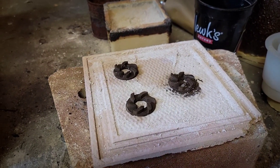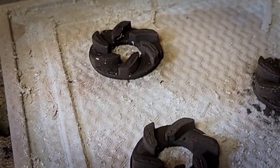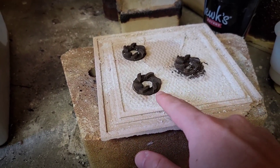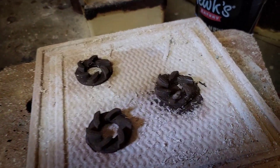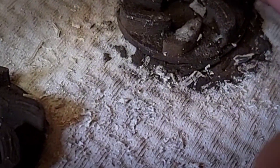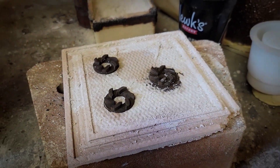I have three steel impellers which I have debound already thermally with the standard kiln, and I did apply a little bit more of spray adhesive because these parts were very fragile. As you can see, just touching that first one broke it, but now I can kind of move it around and we'll be able to transfer it into our microwave kiln.